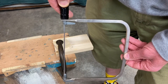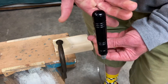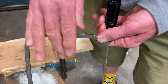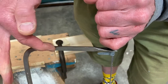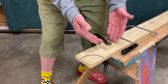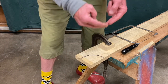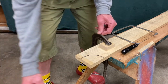Now that we have the correct blade installed, we're ready to use the saw. For bigger kids it works best to hold on with one hand — shake hands with the saw so your palm can push in the direction of the blade. For younger kids it works better to hold on with two hands: one on the handle, one on the spring. I've drawn a line, made my sandwich, the line is about two fingers off the end of the bench. Notice the c-clamp has the handle underneath the bench — if the handle is above the bench it will get in your way.